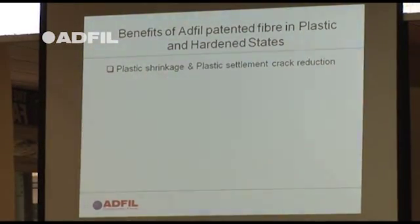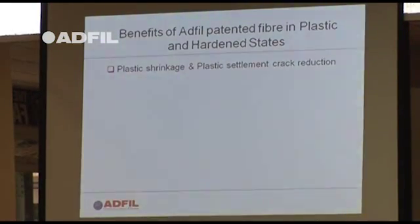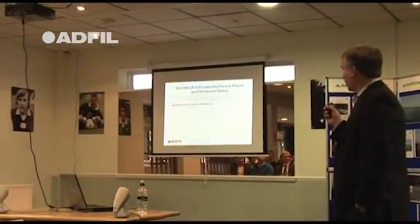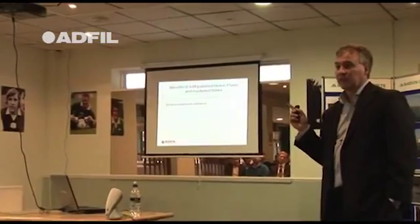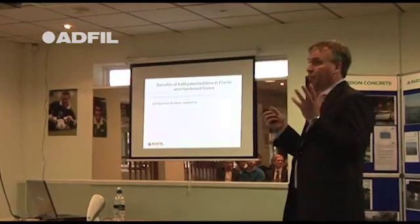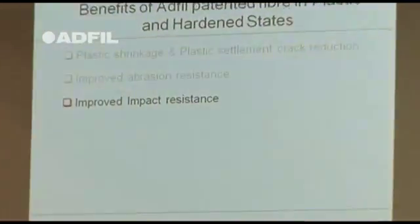For the microfibres, the benefits of putting these little plastic fibres in the concrete are: reduced plastic shrinkage and settlement cracks; increased abrasion resistance. Anything with micro-silica is going to improve your abrasion resistance. A lot of these types of concrete also have polypropylene fibres because they have a propensity to show plastic shrinkage cracks — there's less bleed due to the very fine powders. You've also got improved impact resistance.